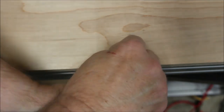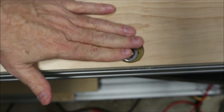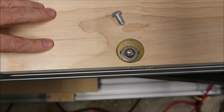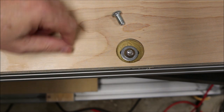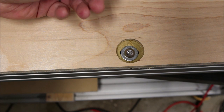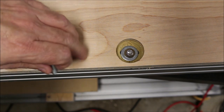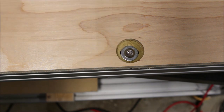By having a washer on it — and I really could have gotten an even bigger washer — I feel a lot better having it fastened like that, especially since I'm going to be putting MDF and T-track on top of this so you won't be able to get to these anymore. These screws were just a little bit short in my opinion. So if anybody from Avid CNC is watching, just a tip from old Dave: you might want to start using a little bit longer screw for this. Even a 20 millimeter without a washer is not going to bottom out in the channel of the extrusion — there's still plenty of room. So 16 millimeters is a little short if you want to try to add a washer.